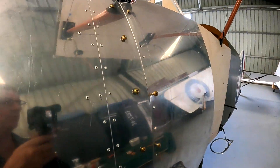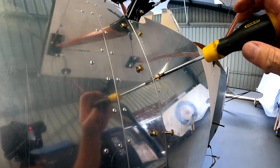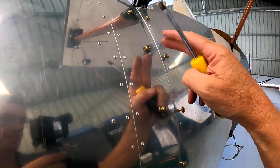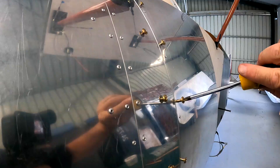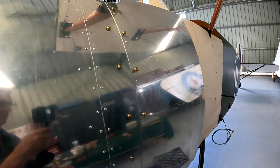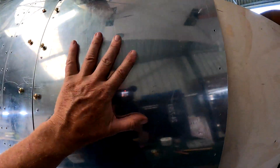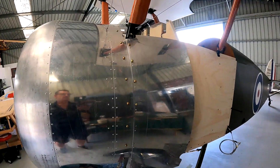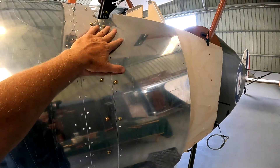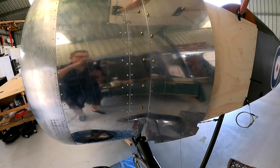Spending a lot of time on this guys, but what I would like is to be able to put the screw in and then it should come to me. It should be effortless to engage the anchor nut. These are all too long, but it's alright - that's what I'm after, all the way around. I don't want to have to stand there and use jemmy bars and mask and tape and whatever. You can see the hole there. I want it to sort of be relaxed and effortless to put it on - that's why I'm spending the time. It looks like those holes - I'll get in there with my mirror. It looks like these rivets might be in the holes nicely. Got out of that one.